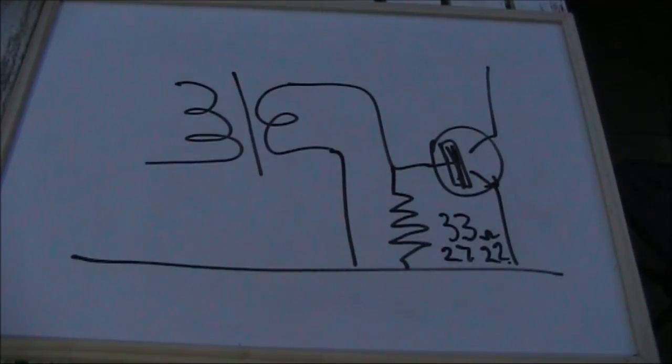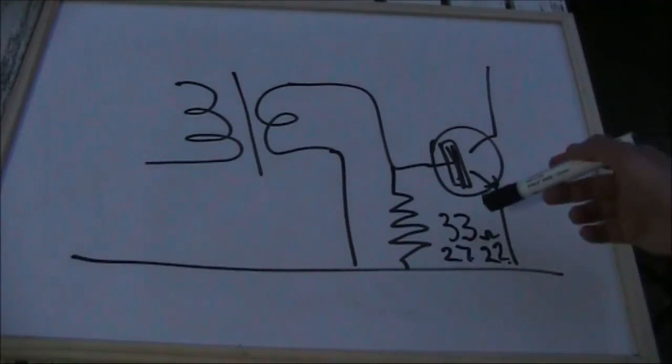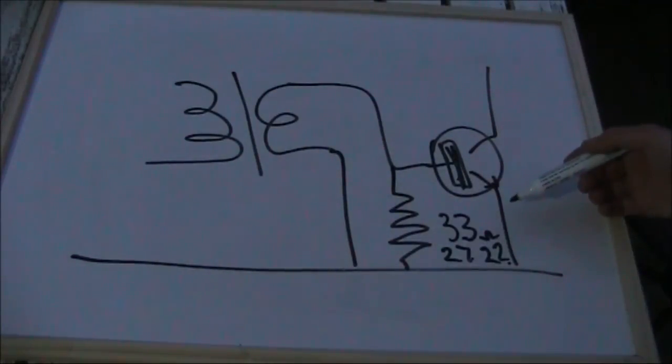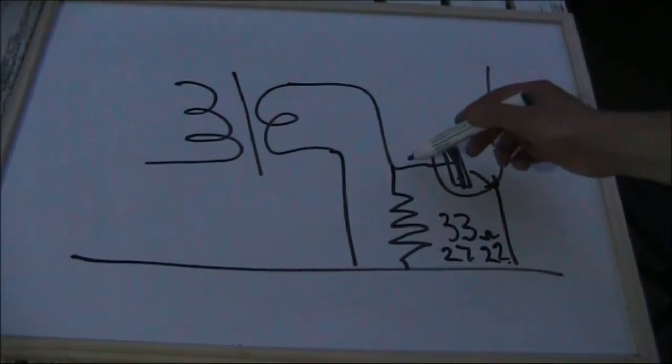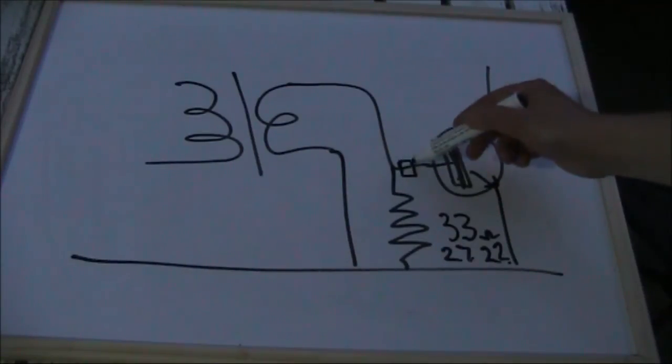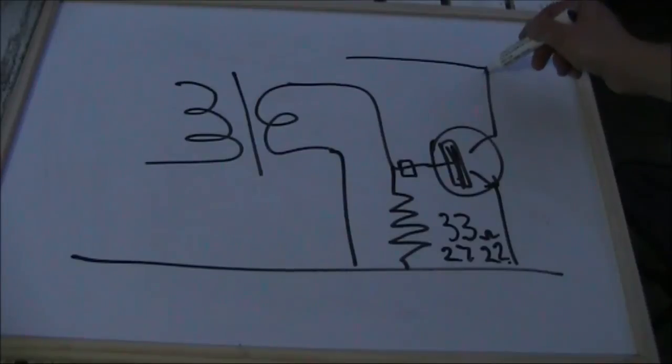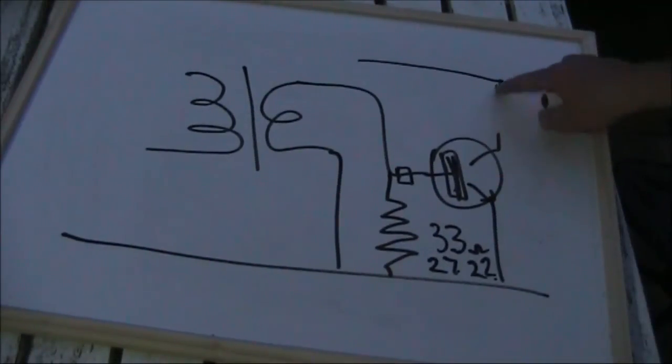Even if you were to build many circuits for their intended bands, you might still need to make some adjustments, and it's doubly so if you're also converting to other bands up or down. Another thing you can do to tame the transistor is to add a ferrite bead or low-value resistor on its base lead. And of course, we probably need some decoupling here.